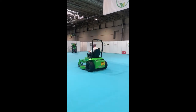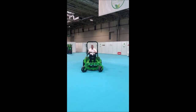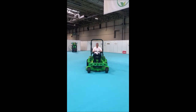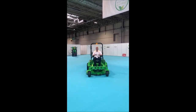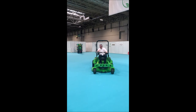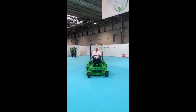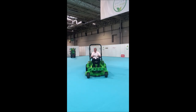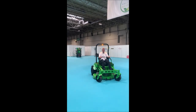It's very, very renewable and easy to use. It is very responsive — probably more responsive than most machines, as you'd normally get lag from the hydrostats and things like that. It's very, very lightweight, weighing around about 520 kilos. There's no engine, so obviously no servicing, and no fluids. The new design puts the wheel motors in the wheels and the battery cells fit down between the wheels, giving it a much lower centre of gravity — it's slope-rated at around 20 degrees, which is better than most standard machines on the market.